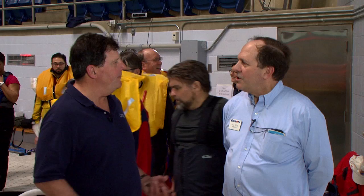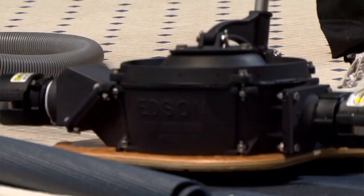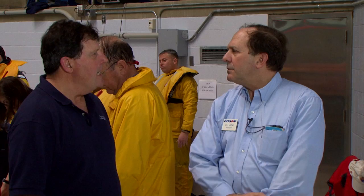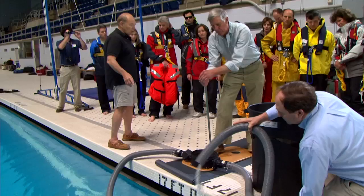The philosophy of a bilge pump is to be able to generate the capacity needed to deal with any water ingress into your boat. The first thing you need to do is understand how much capacity you have, both for your electric pump and for your manual pumps. You want to find the leak and stop it. Make sure you get your electric bilge pumps going, and then go look for the point of ingress. If you can't stop it, slow it down, so that you get to a point where your pumps can handle what's coming in.